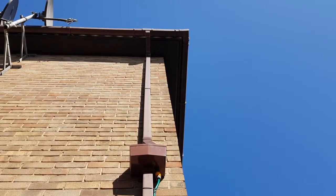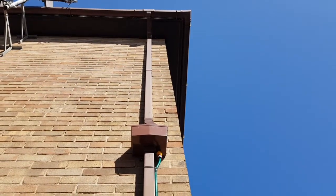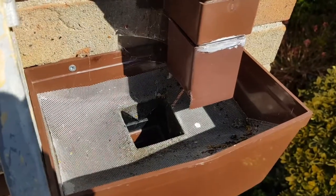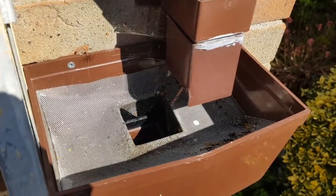Hello, I thought I'd make a quick video explaining my rainwater collection system. I cut into the downpipe a little above the first floor level and installed a dogleg just above a modified hopper.